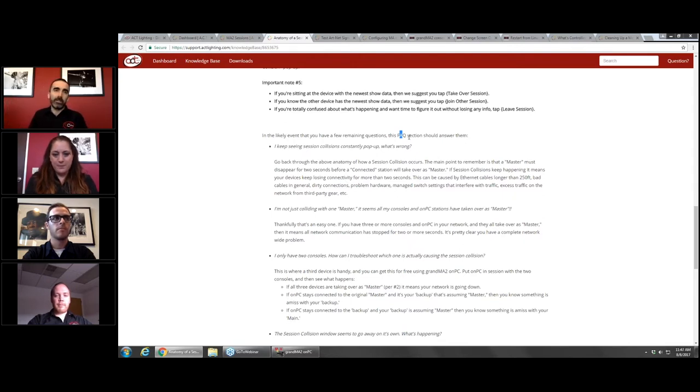That's why we definitely suggest EtherCon. Those are rated for a little more plugging life cycles. However, the little pins are still standard RJ45 stuff. So we know a lot of folks that do the big, very important TV shows. They don't want any problems. Guess what? They always buy a brand new cable. They throw it away at the end.